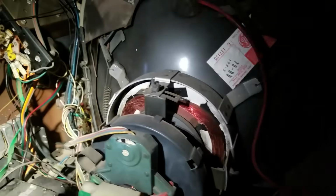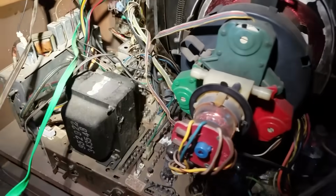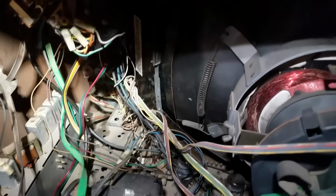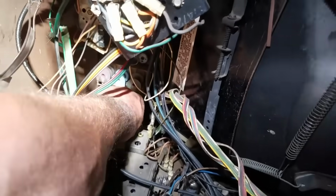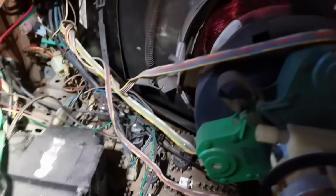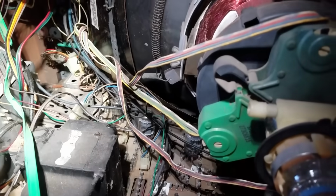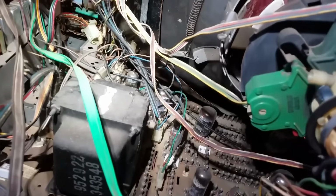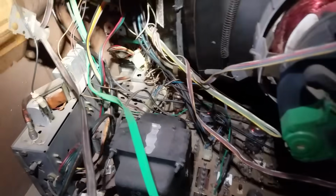Man, this thing is... Boy, this thing is emitting all kinds of different odors. Let me unplug it here. Corona. Okay, the convergence assembly on this is up front. So I'm going to reach in here and unplug it. There's the plug. So the convergence, wow, that's a burning smell. The vertical output transformer on this can either short from the, yeah, there's smoke coming up. It can either short from primary to secondary or to the convergence winding.